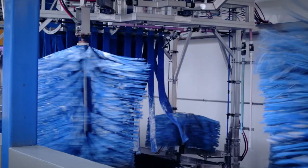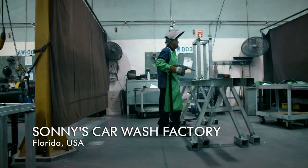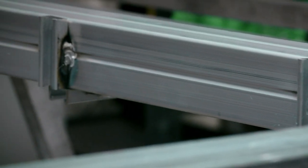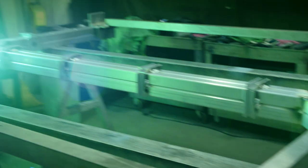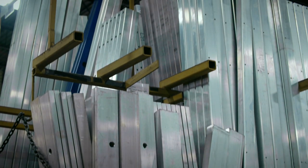The inside of a car wash is a hot, wet, chemical tornado — one of the most hostile environments you can imagine for any machine. The secret to the car wash's resilience lies in the way engineers build the huge metal skeleton that holds it together. These metal arches support all the car wash's crucial machinery, from the soap sprays to the brushes and dryers. They'd quickly corrode if made of normal steel, so welders make them out of aluminium girders that are completely immune to rust.